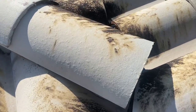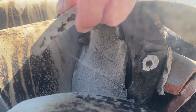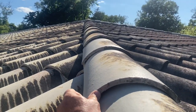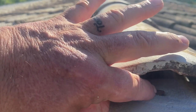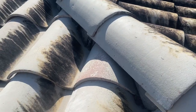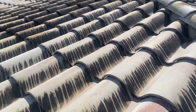We were just talking about how the grout can come loose. I was just over here and see this tile right here — this grout has detached under here. You can see how it's just cemented into place; that's what's holding it on. So this one's loose right here, this one's loose right here, and finally it starts to hold again up here. Now these were nailed into the truss so they may not slide off — there is a small nail hole right in there nailing it to the wooden truss. But if that nail or fastener has rusted through, you could have a catastrophic problem with it sliding down.